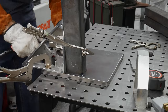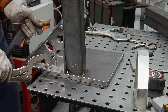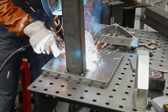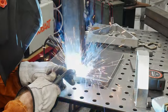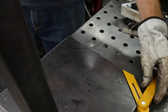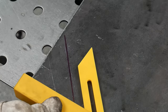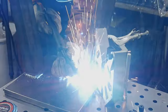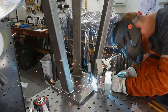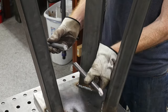I clamped the front leg in place with a fireball square, tacked the four corners, and then laid down my main welds with my Hobart 140 handler. I ended up going with a 51-degree angle on the other two legs, though 45 degrees would have worked fine. The legs are kicked out a little less at 51 degrees, but be aware that taking this angle to the extreme will reduce the stability of the stand given the relatively light weight of this anvil.